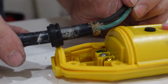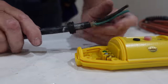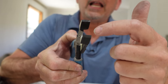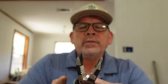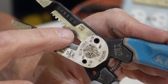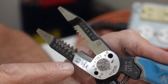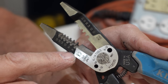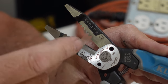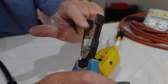Now it's time to strip these wires. Big shout out to Klein — they sent me these heavy-duty strippers with a lineman jaw on them. One thing we want to point out: this is stranded wire. You can see here it says STR — those are your stranded wire sizes. On the other side it says SLD for solid wire. It's very important to use the right size hole for the correct wire type. For number 12 stranded, we're at the second hole from the bottom.